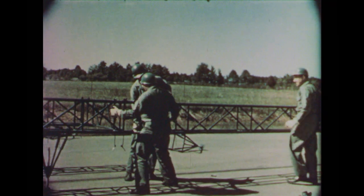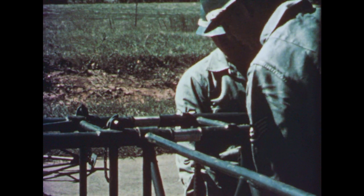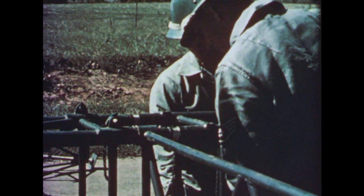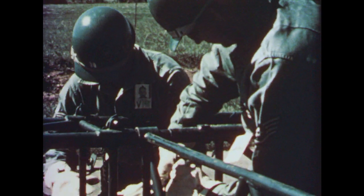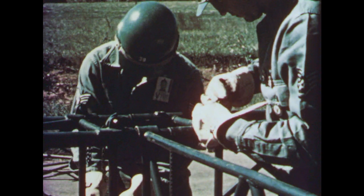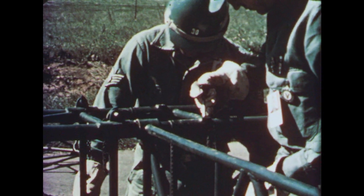All slip joints are kept free of mars, burrs, and corrosion. Before and after each emplacement, the slip joints should be cleaned and a light film of lubricant applied. Sludge formation should be removed with dry cleaning solvent. Self-locking pins hold the H-frame sections together.